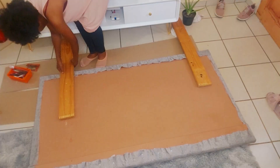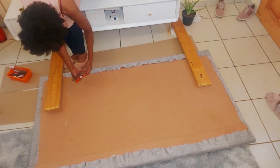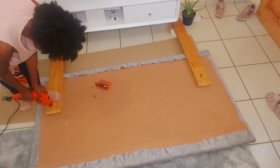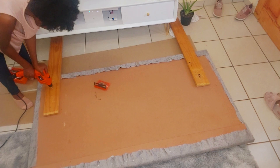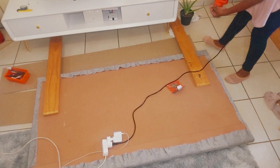Then you have to apply the legs — you can use anything you have on hand. What I did was measure the height of my bed plus the height of my furniture legs and cut the lumber to size. I attached the lumber onto the back of the headboard itself. If you want to cover the back of your headboard you can go ahead and do so — you can add a lining at the back and staple it down.